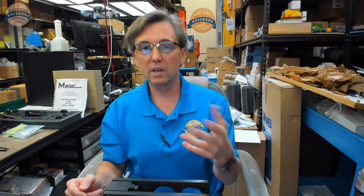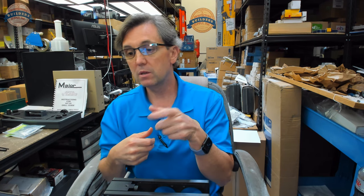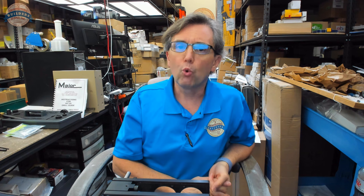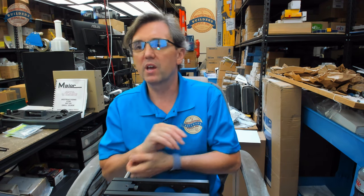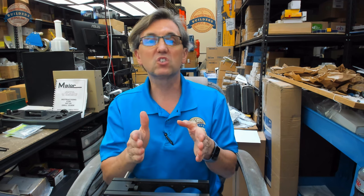Likely a cylinder, or the spindle of a thumb turn, or the 5/16 keystock spindles for the trim itself, the mounting screws to go through. If it's a cylindrical lock, you don't need to worry about that stuff. You're going to order the cylindrical lock, and I just requested a quote for a client, for a 2 3/4 inch thick door, this was extended equally. So however the door got to be 2 3/4 inch was made that way.